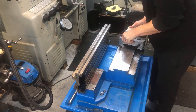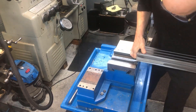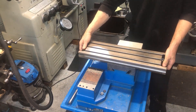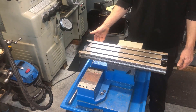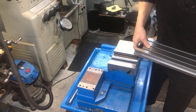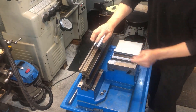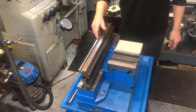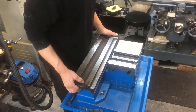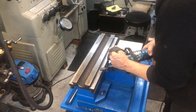This is built together like the dovetail system here, and then on top comes the saddle, and on top of that again, of course, the table. Here we have two exposed and two unexposed ways. If I take away the table here carefully, this will reveal the unexposed ways — the first under the table — which is of course appropriate to flake. And this is accessible, so I can use the BIAX flaker here.